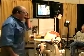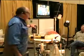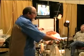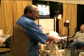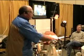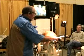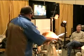Are we okay so far? Everybody kind of has a good idea of what we're fixing to do here? Always start your lathe at the slowest possible speed, because if this is not balanced or you forgot to do something, it's going to come off. And the kinetic energy is a lot less at 2 RPM than it is at 3,000. It won't go quite as far. Now, as I bring this up, you probably are going to feel a little bit of moisture out there. Because this is really a wet piece of wood. Let's turn a little wood, folks.